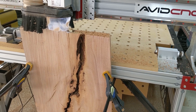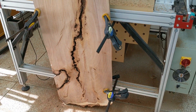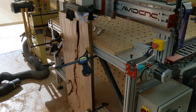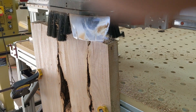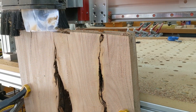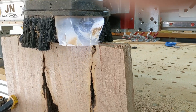Clamping this on, I can make this slot in a matter of minutes — it's just clamping this on roughly parallel or roughly horizontal on top, clamp it to the frame, cut a slot back and forth, and it's all done. It really couldn't be easier. It's much faster than making a router jig or something like that to cut this slot.